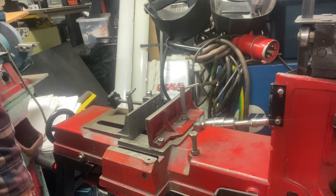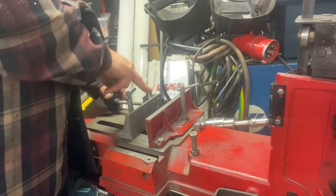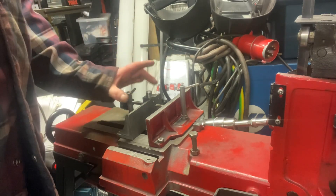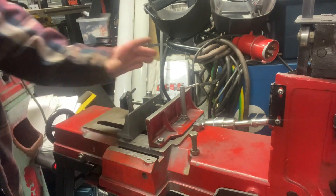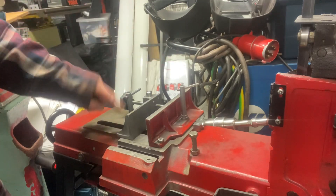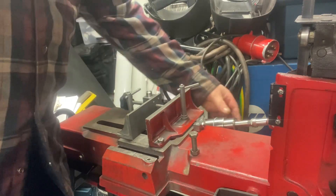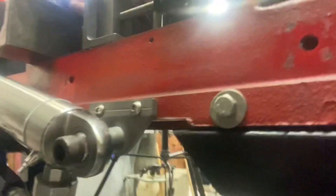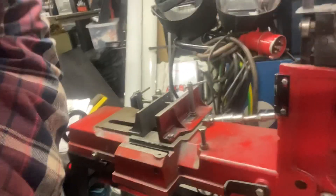While the saw is cutting when I'm using larger stock, I think this is just a great addition to the machine because it saved me winding in and out and getting frustrated with that very small jaw, which really wasn't big enough and was also difficult to lock down. There is also a good reason why I've put these clamps above: this is my hydraulic feed system and if I'd had a clamp underneath, the hydraulic system — because it goes down quite low with the gauge — would have been in the way. I wanted it all above so that it was easier to see and easier to operate.